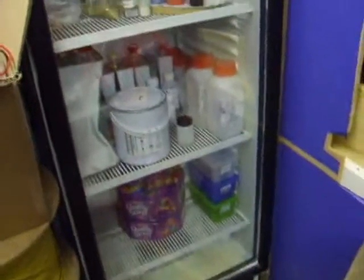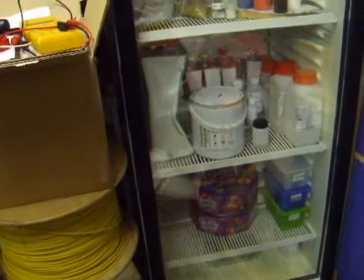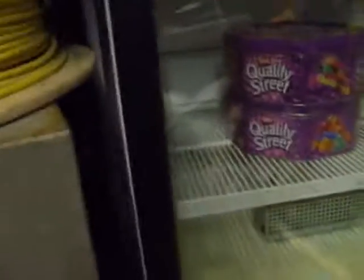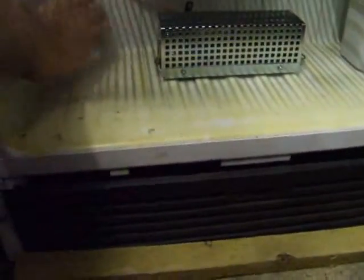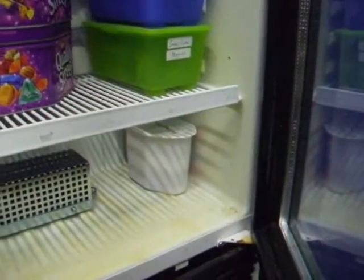But the intent had been for a long time to put in a small anti-condensation heater, which is a ceramic bar heater. It's only 80 watts in a metal cage down the bottom there. Obviously that takes up a lot less space, and it actually fits in the recess, because you've got the step in the base of the cabinet here, where the compressor for the fridge is behind there. So it fits quite nicely in the front there, with a little condensation trap just in the corner.